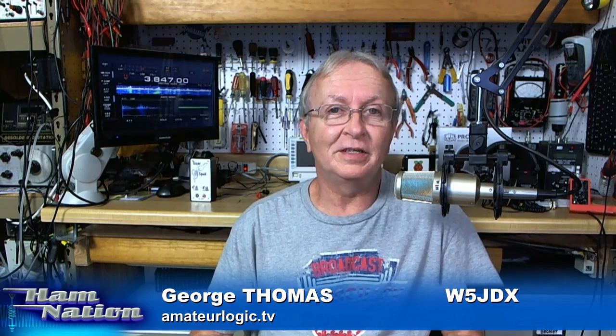They say for an 80-meter loop you can just feed it with coax and don't need a balun, but I think you probably do — it made a big difference here. Thanks to Joe for providing the materials, inspiration, and instructions. You should try one yourself — it's a lot of fun, and you always need a four-to-one. This one's probably going to go to field day with me this year.